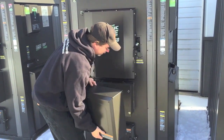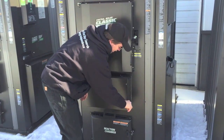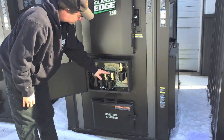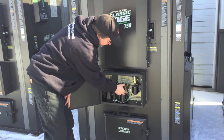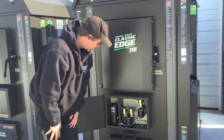Basically, you just pop off the outer cover, open up the inner door, and in here you're going to see one combustion fan and three solenoids. The air is introduced in, and these solenoids are opening at different times, letting air into the firebox when it's needed.